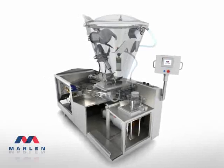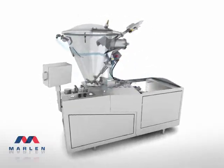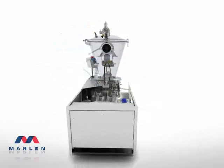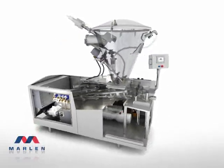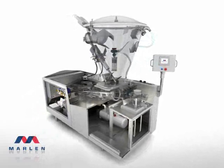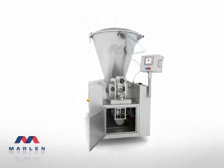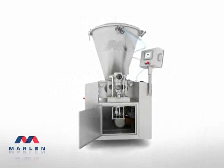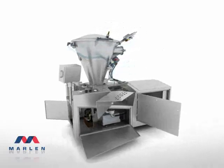The environmental issues and the constant demand in your plant can take their toll on any piece of equipment. Serviceability and cleanability are critical to the performance and longevity of your operation. Marlin designed and built the Opti 200 to survive that environment with ease of maintenance and the assurance of safety. It follows a simple, common-sense approach to access. For example, the front valve housing on the Opti 200 raises up to allow you to change the seals, as well as providing an unobstructed view to verify cleaning. The panel below gives you access to the front valve, proximity switches, and other elements that might require maintenance, troubleshooting, or repair.